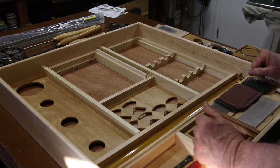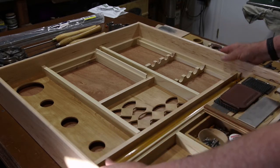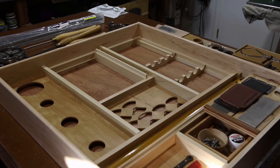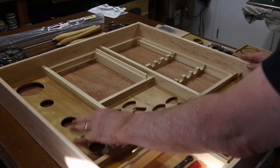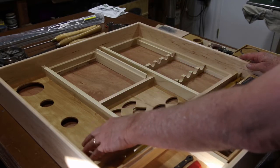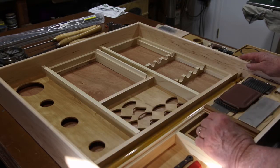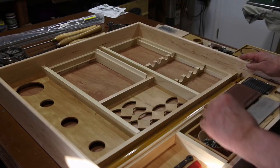I think that's the beauty of it. Also, by the way, the construction of this drawer is 1/2-inch maple. The other first drawer is 1/2-inch plywood. Whatever medium you choose works well. The pockets are made out of 1/4-inch plywood. 1/8 works as well, but 1/4-inch, like you saw the trucks go in over here on this side, and they're pretty heavy, so I didn't want to have the sag.